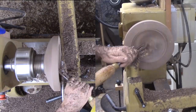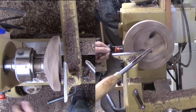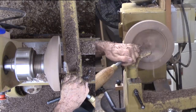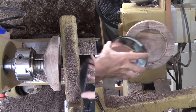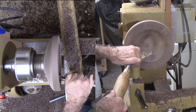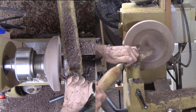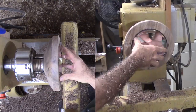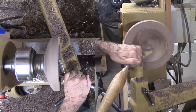I mark an estimate, mark around the surface, then check the measure. To me, this is a much safer process than pressing points to a rotating wood. I'm using a box scraper to cut the mortise, then test and repeat until the top fits. Then I can guess at the hollow needed for the remainder. Fortunately, an exact hollow is not required for the bottom. A little loose will be fine.